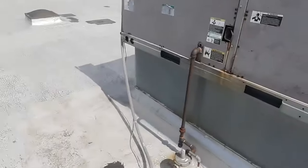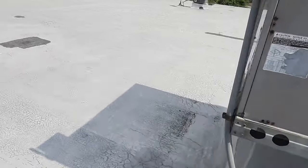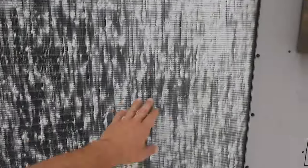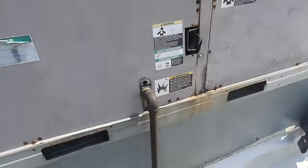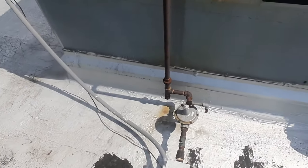What's up guys. Old Carrier unit not cooling - sounds like something's running, fan's running. The coil is beat up, this is an old one. Can't do much with that, I got a combing out a little bit. Let's get these panels off - from what I understand somebody's been here a couple times and fixed a low voltage short last time, so we're gonna get our panels off and see what's going on inside.